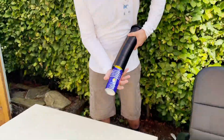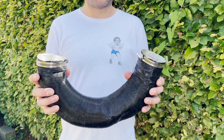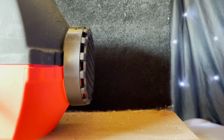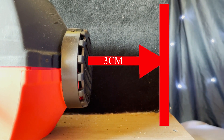Error code 05 is an overheating code. This could mean that something is restricted somewhere — it could be that the hot air ducting or vents are blocked, or as simple as you have put a bag in front of your air vent restricting the hot air. It could also be that the bends in the hot air duct are too harsh. You are also meant to leave enough space between the fan end of your heater and any obstructions — if you do not have at least a 3cm gap, your heater can overheat and give you an E05 error code.